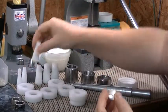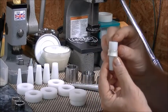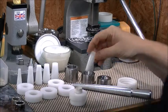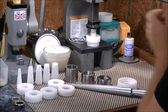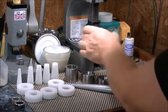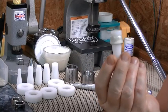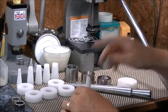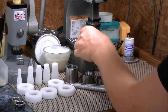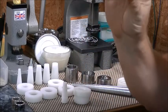So what I'm going to do now is use the same cone I had before, because I made it up this far on the cone and it started work hardening on me — so I annealed it. I'm going to take this and press it back in. Make sure your cone is lubricated. Press it down — a little bit more. Getting a straighter ring, much straighter ring. Now let's release it: flip the cone over, make sure it sits well on the lid, press it down. Our ring is right there getting a much straighter wall.